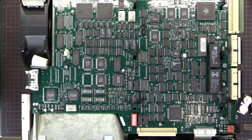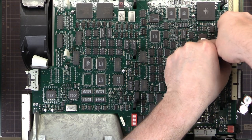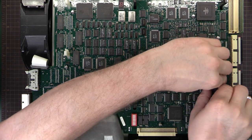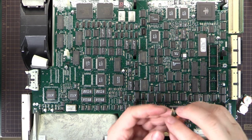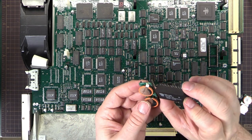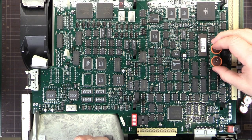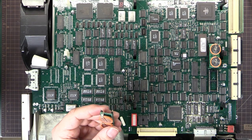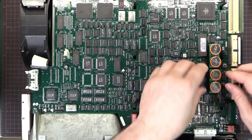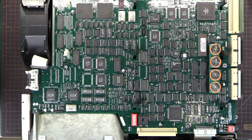You want to download the firmware and the NV RAM. Then when we put the new chips in, we put into programming mode and upload it back into the new chips. I've removed chips 1 and 2. The one towards the back is the DS-1486 — I can see the little bevels on the corners to indicate direction. That goes in there, and then the DS-1250Y — functionally the same as a 1650Y in this application — goes in the other socket. If I turn it on now it will give errors, so I'll load the firmware and NV RAM first.